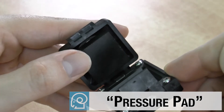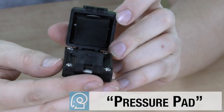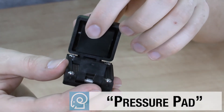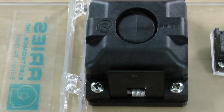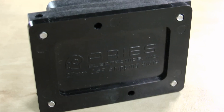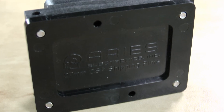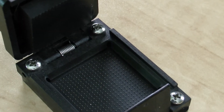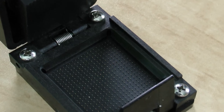A modified custom pressure pad is positioned into the lid of the socket sub-assembly. The pressure pad thickness and shape all depend on the thickness and type of the device being tested. The pressure pad bottom surface will be flat for CSP, BGA, LGA, and leadless devices such as QFNs. For devices with formed leads such as QFPs, a pressure pad with raised rectangular blades will be created to back up the formed leads during contact with the spring probes.